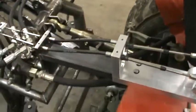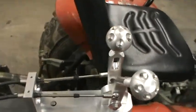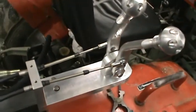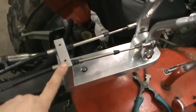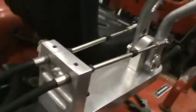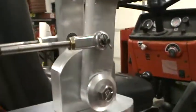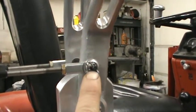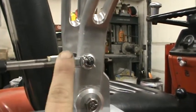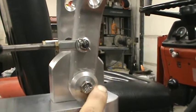Here's the levers. I guess I had a little bit too much time on my hands, but I machined these out of 6061 T6 aluminum. This is three quarters of an inch thick. Done a little ball milling back there. I just made it where it all bolted together. Got these little hemispherical rod ends — some people call them Heim joints. They go here. I got a roller bearing, sealed bearing inside of this cover.